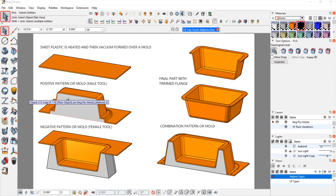There are a couple of different mold shapes. The first is a positive mold, where we take the material and form it over the top of the part. Another type is a negative tool, where the cavity is in the tool and we use suction to bring the plastic down into that part. We're going to focus on the positive pattern, since the negative pattern requires the tool to go down below the trim edge of the plastic and takes a lot more material.